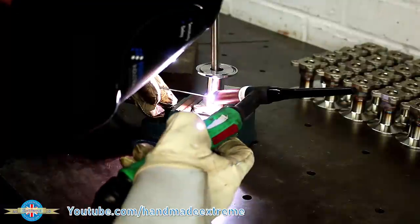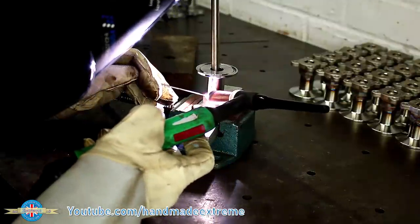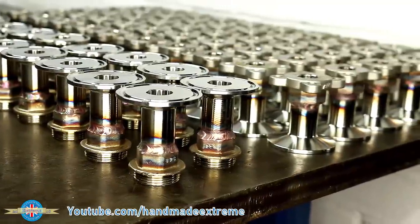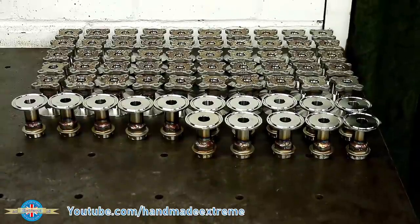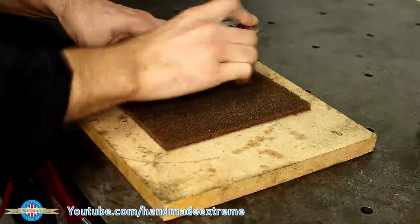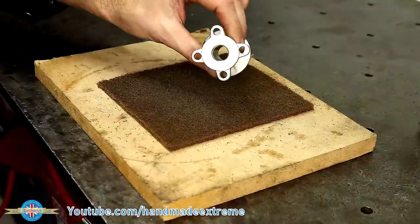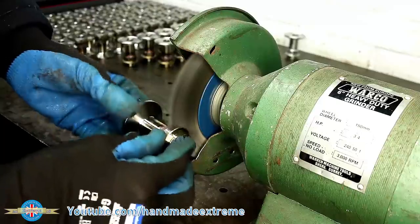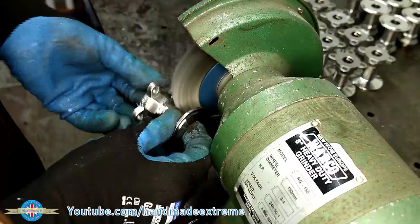That could be the next video, so if you're interested in seeing that, make sure you hit that subscribe button. Here they are, all welded up — I think they've turned out really nicely considering I haven't done any for a while. The brown staining that you can see on the valve faces is just where the tape adhesive is burnt onto the surface. This is easily removed by rubbing the surface lightly on some Scotch-Brite — I typically find between 40 and 60 strokes gets rid of all of the residue.